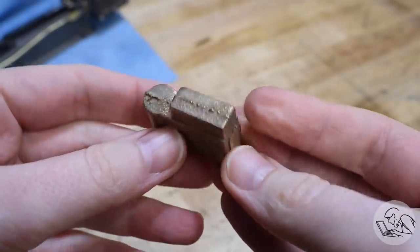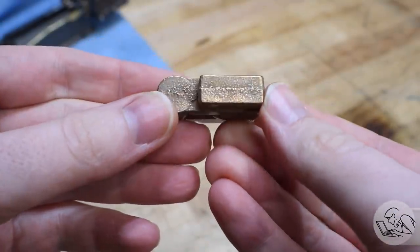I'm going to make the crosshead. This is a unique feature of steam engines because steam engines seal both ends of the cylinder, which means the travel of the piston rod has to be linear. So the crosshead translates that linear motion into reciprocating motion for the connecting rod and the crankshaft. Here's the casting that came with the kit - it's quite lovely actually, there's some art deco details in there.